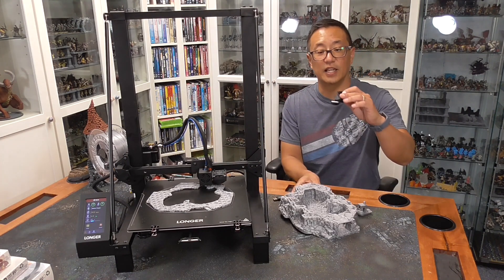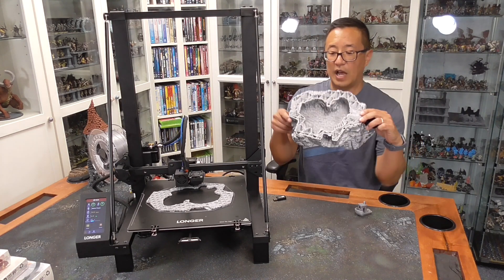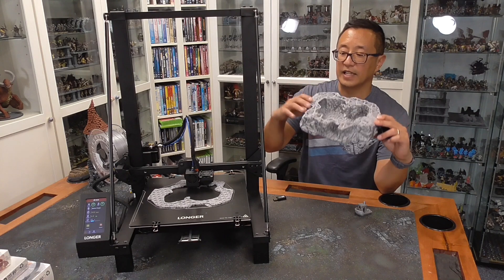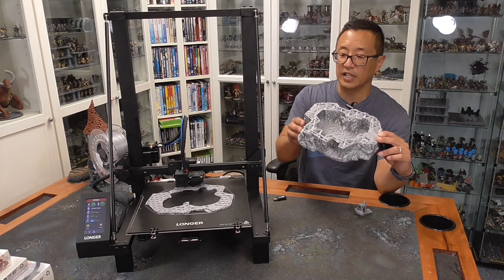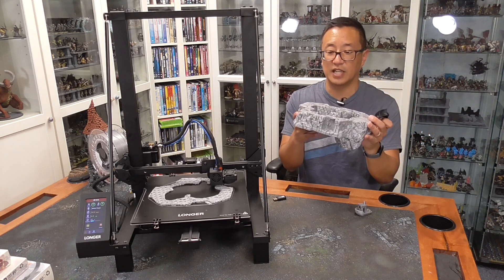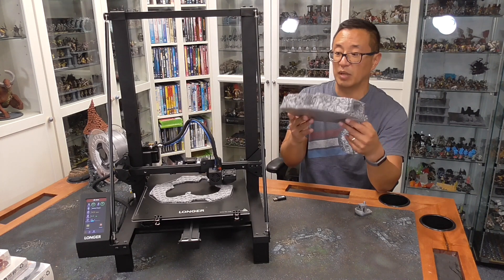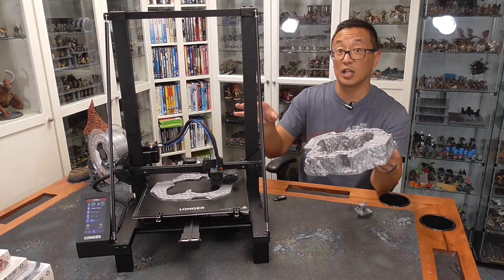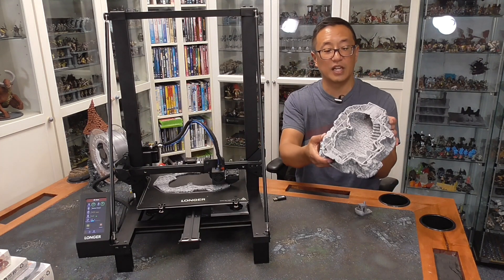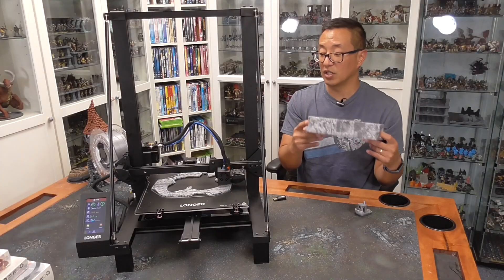The add-on fan shroud that I pulled off of Thingiverse was a little bit too long. Also at my fault, I put it at 5% infill rather than probably what would have been better with 10%. When it started laying down some of the flat pieces, it curled up because it didn't have anything to attach to. And because this was so close to the print, it actually hit the print and dragged it sideways, creating a shift right at the 36-hour mark. Fortunately, I was able to catch that soon enough to stop the print, and now I'm just printing the top separately. So far, the quality of this looks as good as my Prusa MK3S as well as my Prusa Mini, so I'm really happy with the quality of these results.